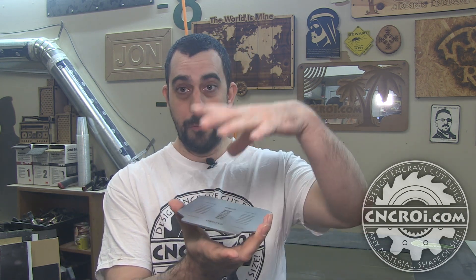What are some limitations of deep etching? On aluminum it would be much easier because it's a softer metal than stainless steel. But when you introduce all this power and energy onto the stainless steel — and the same happens with polycarbonate — it gets really hot. Because it gets so hot, the material tends to warp. The top surface is warmer than the bottom. Regardless of thickness — this is around 12 gauge, a little less than one eighth inch — if you keep pounding it more and more, it starts to warp and then actually wants to start spinning, which is a strange effect.